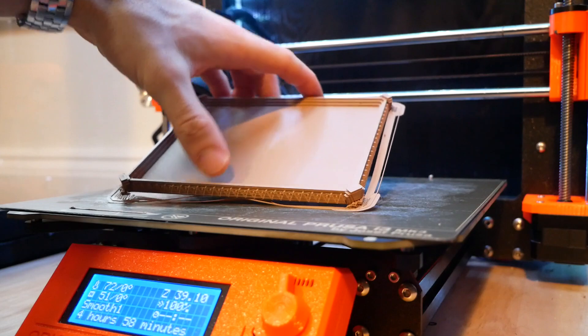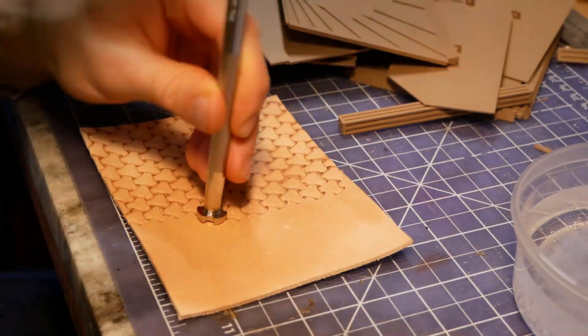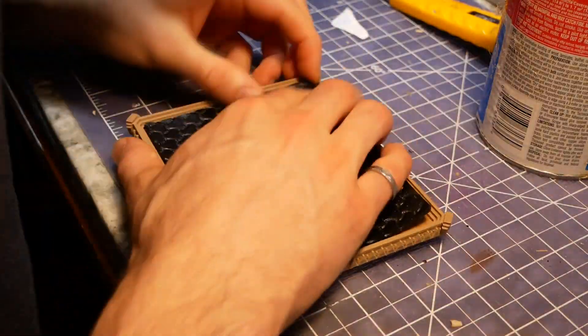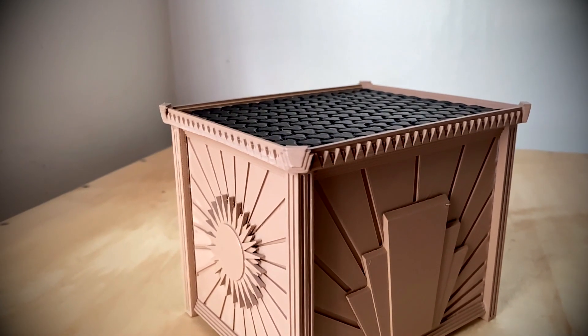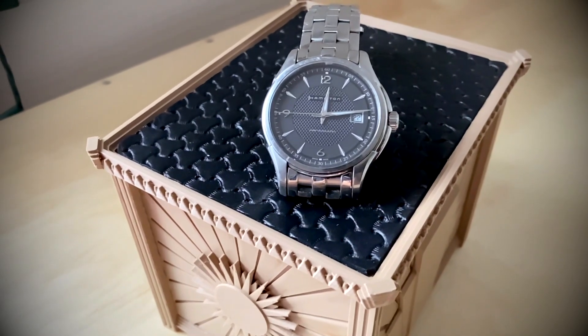I am so excited. But there is one final detail I want to add before I can call this project done. From the very beginning of this project, the top of the lid always felt a little empty, and it took me a while to figure out the right way to fill this space. Eventually I realized this would be a great opportunity to really play up the art deco aesthetic and add some texture and color. So I took a piece of veg tan leather, stamped it with a basket weave pattern, dyed it black, and then used contact cement to inlay it into the top of the lid. The black patterned leather adds so much texture and visual interest and makes it feel way nicer than if it were just wood PLA. It also makes it really inviting to use as a catch-all. And actually, that gives me an interesting idea — if I put a wireless charging adapter inside the box, I could turn this into a really cool wireless charging station. Maybe a project for another day.